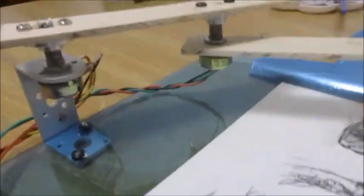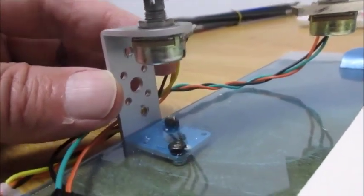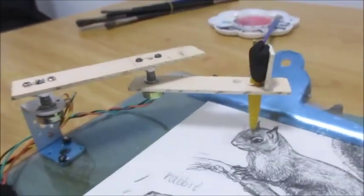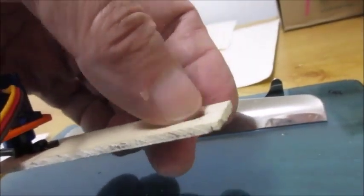Here are a few details about my pantograph. These are just 10k potentiometers, and I used aluminum brackets from a robotic arm project — one potentiometer there, one potentiometer here. A couple of equal-length arms, though I don't think that's the right proportion — I think this arm needs to be longer, so I'll try changing that next. Then two micro servos, 9-gram servos, bolted onto some hobby plywood. This happens to be a servo bracket, and I have a hole here — I need to get a better holder for the pen.